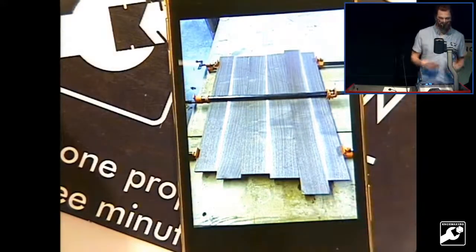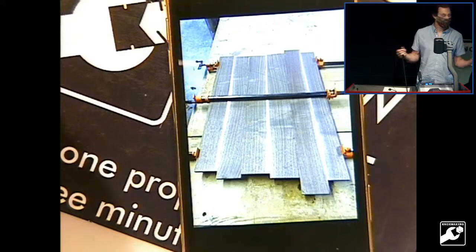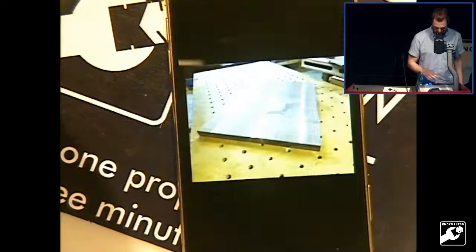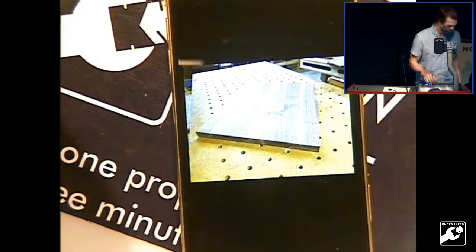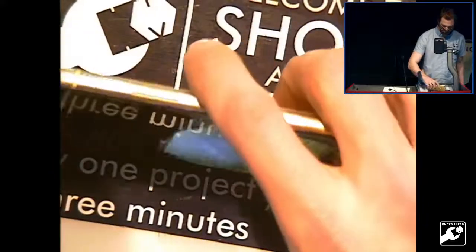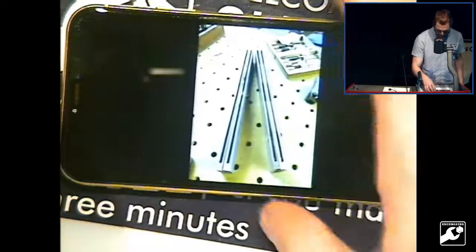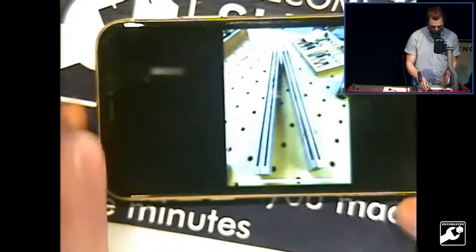So here they are glued up. But anyways, I took like a month-long hiatus from this project, and the humidity changed a lot between now and then, and the boards started to cup on me a little bit. So I had about an eighth inch of cup on them before I actually got back to the dumb thing. So here's the breadboard ends I ended up making for it.